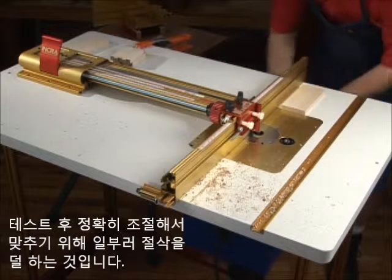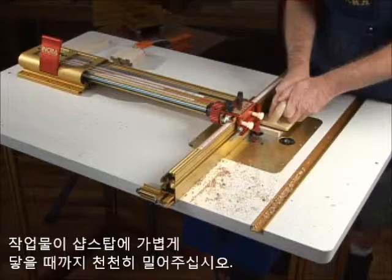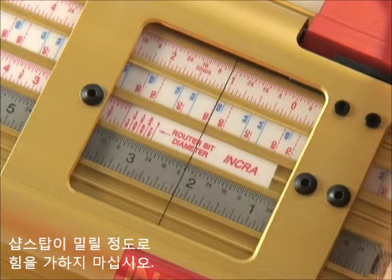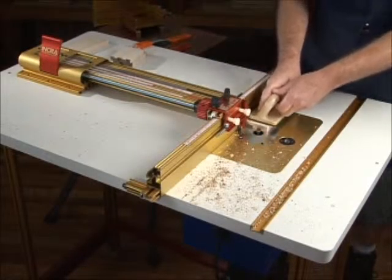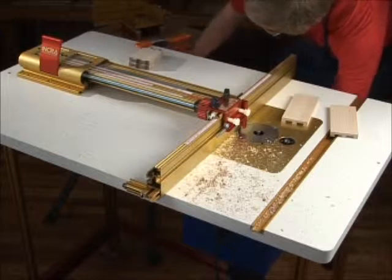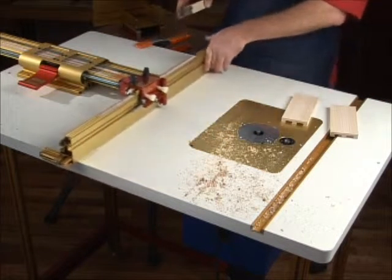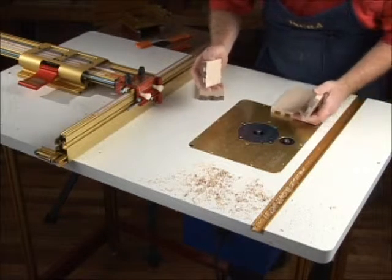For the pin cuts, move the LS to the first D cut that exposes the cutter outside the fence, 9D in this example. Bring the shop stop up to the outside diameter of the cutter and clamp in place. Again, this setup will always produce a socket that is a little short, so we'll only cut one end of one piece at this time, then adjust as necessary.